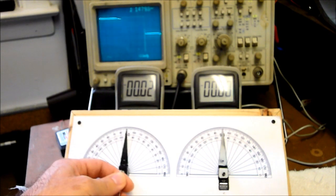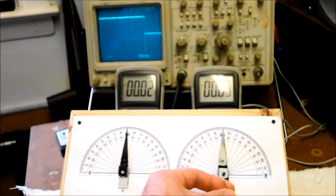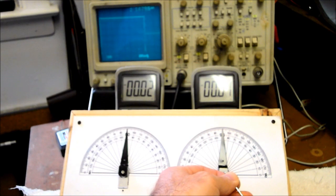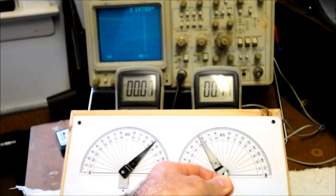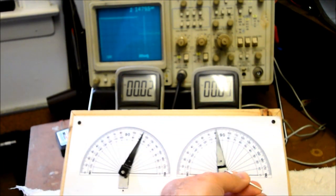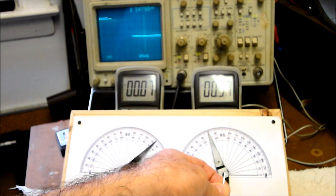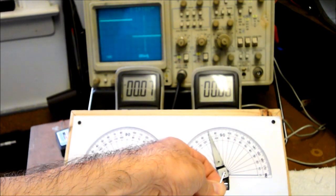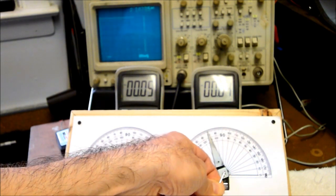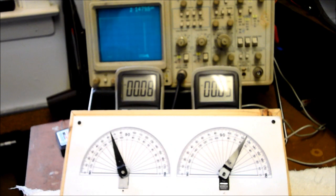So the Turnigy uses 1.14 amps when installed. Let's see the Align. There you go. The Align uses 0.6, so it uses a little bit less current. But again, the specs on the Align say it has a force of 1.8 kilograms. The Turnigy has a stall torque of 3 kilograms, so almost double. So yeah, it's going to use a little bit more current.